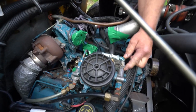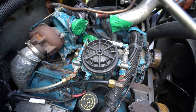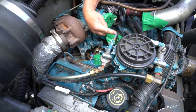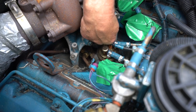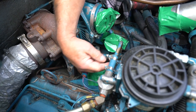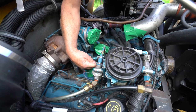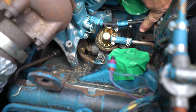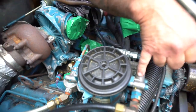The International has this line coming up here to a pressure regulator right here. This sets your pressure at 35 psi. So now I'm going to show you something that nobody tells you. Here's the line coming in from the fuel tank — comes through here through a strainer, down this steel line to this side of the pump. From this — this is a dual system pump — it goes to this line which comes back up here, up through this line and into the fuel bowl. From the fuel bowl, it pressures up and comes back down at 10 psi into the bottom of the high pressure pump. High pressure pump comes out at 35 to 40 psi. That's what this check valve here is — your pressure regulator.